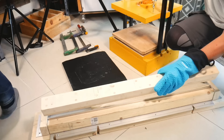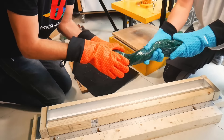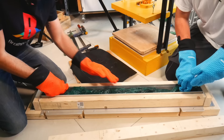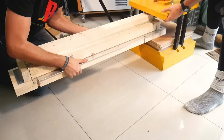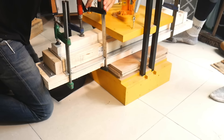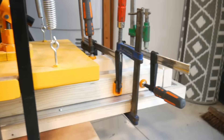On to the scary part. We had to be super speedy here because HDPE cools super quickly. We took it out of the oven and gave it a few folds and twists to get it to the rough length of the mould before throwing it in. We used our bottle jack press to clamp the middle section of the mould and then a few clamps on either end — you could absolutely do this with just the clamps as long as you're quick. We did get a little bit of bowing on the sides so we came back and added some extra clamps there as well.